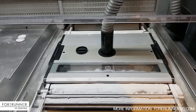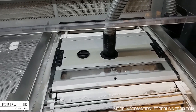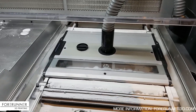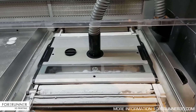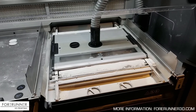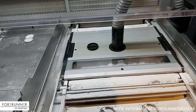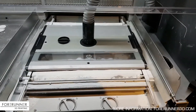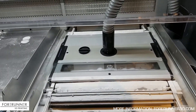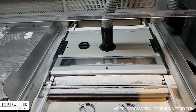We can't just quench it — we can't pull it out and start digging in, even setting aside burns, because it might cause part quality issues like warping from cooling too fast. It can take 15 to potentially 20 hours to fully cool one of these buckets before you can break the parts out. The machine itself prints at almost an inch an hour, give or take depending on settings, and then you still have to cool it. They call it fast cooling, but it still takes quite a bit of time.